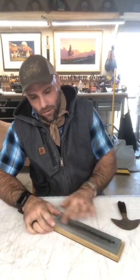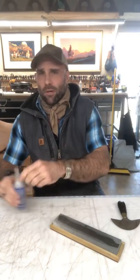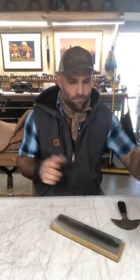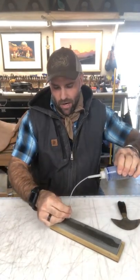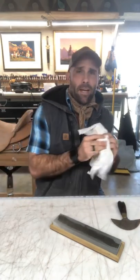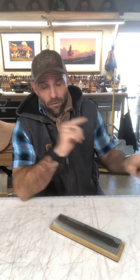This is something that takes a lot of feel, and you get used to it over time. Initially, this part's not going to be very good — you're going to struggle to maintain where your edge is at. All I can say is keep going; it gets better. You can use a Sharpie to help yourself — actually Sharpie the edge of your blade and then inspect it as you go to make sure you're sharpening the part of the blade you think you're sharpening.